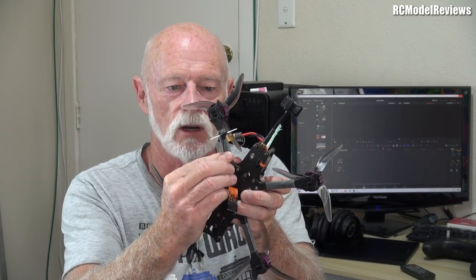I tremble a little bit when I see people mounting these antennas on the arms of a quad horizontally, because as your quad is yawing, the null points will start pointing at your transmitter and you'll get a sudden drop in RSSI. And if your transmitter antenna is pointed at the quad at the same time, bad things can happen. You might think: why not run vertical on the transmitter and horizontal on the craft? Unfortunately the world doesn't work that way, because if you run vertical on your transmitter and horizontal on your receiver, you are what's called cross-polarized, and that's a really bad thing. I'm going to show you why with this little demo.